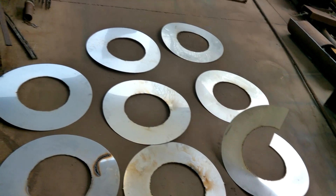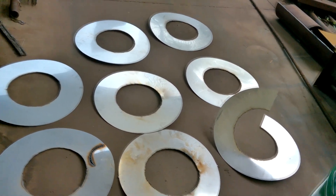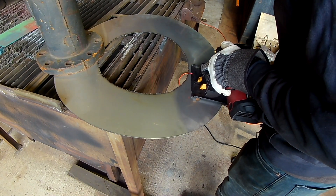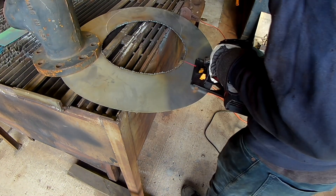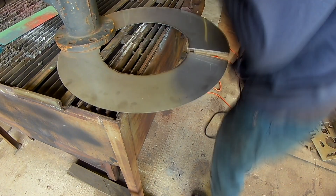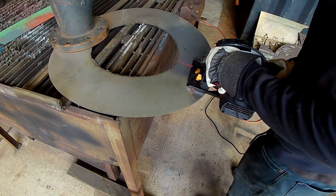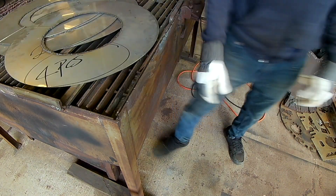I had about eight discs here. The idea was to double them up because in the previous auger it was kind of flimsy — just one ply — and it's better to go thicker. So I decided to cut all eight out and weld them together two per blade so it has more sturdiness. I'm cutting these out with the circular saw — it's got a little laser on there, goes perfectly straight every time, no sparks, no mess. Cut them all out, got all my little frisbees right there — gotta get the ground clamp on, turn the welding machine on.